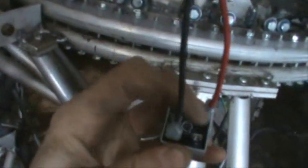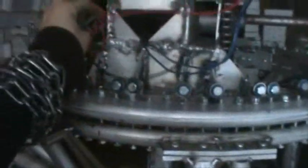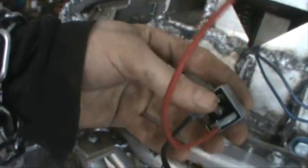Why isn't there like a red and a black? Anyway, up here is my rectifier, and I can put AC coming into these two slots, and then DC will come out of these slots to my motor. The motor is rated for 130 volts, so regular house voltage — in North America at least — of like 120-ish, is good. I just have to attach a plug to these ends.